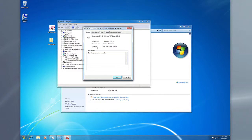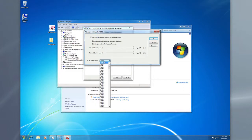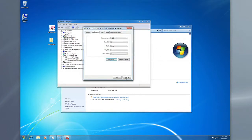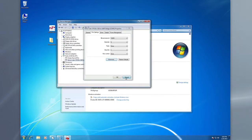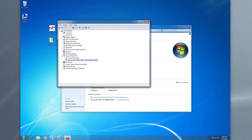Try swapping your connectors around to see if that clears up the warning. If not, let's manually switch our ports around — go to Advanced and choose another port from the list, keeping in mind you have to stay between 1 and 16. Choose another port until it recognizes properly and the warning flag is removed. Once you find the proper port, make note of it and address that in the software.